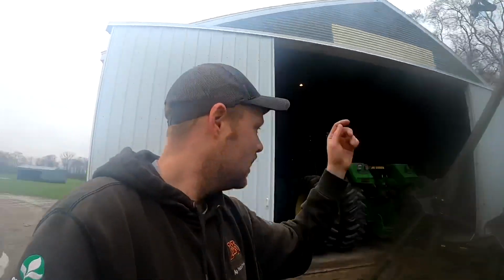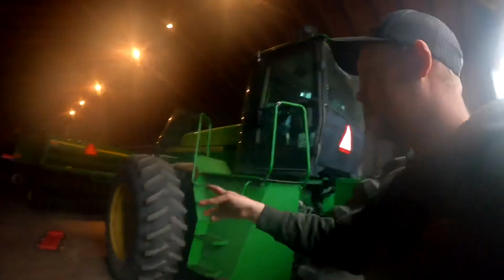So what day is it? 9th of May. It's Monday the 9th. On Saturday, this past Saturday, I was able to get this out in the field. Came out this morning, discovered that I meant to work on the drills, discovered that this had a pretty bad antifreeze leak. I hope I fixed it. It looks like I did. So hopefully problem solved. That was a new hose that they put on in Manoman when it was really cold out, and it must have just not mated properly to the nipples on the radiator in the tractor, but hopefully that's taken care of now.